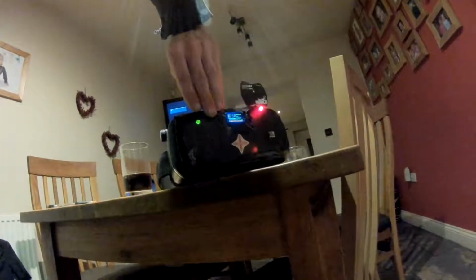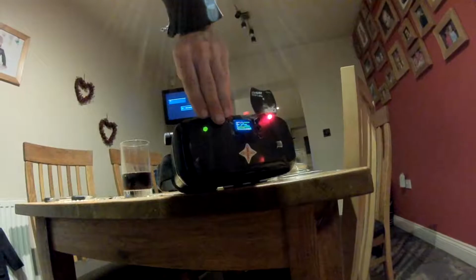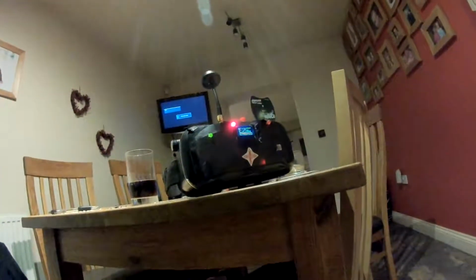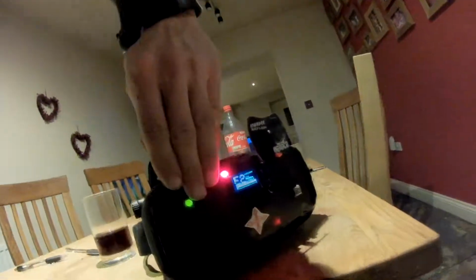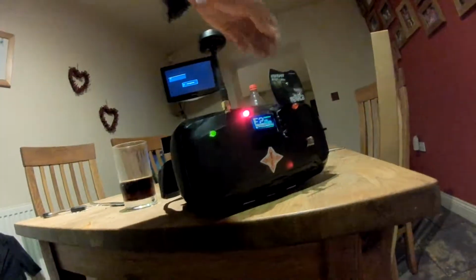There you go, the diversity is now switched to the patch, so the other LEDs come on, and you can see the scales under the E2 there. A antenna is dropping a bit more than B. Let go, switches straight back to A, because that's the default. Plus it's probably getting a stronger signal at the minute, although they're both right at the top, so we can do that again. We cover it, and it switches over. And that's it.